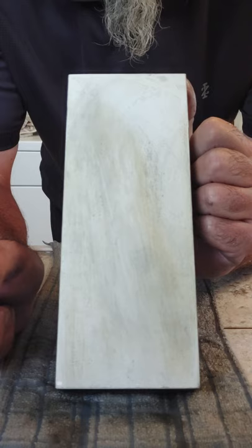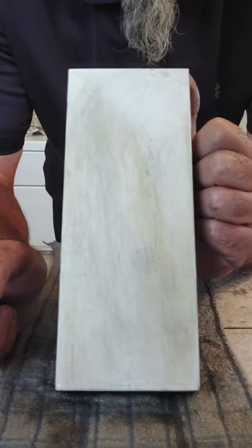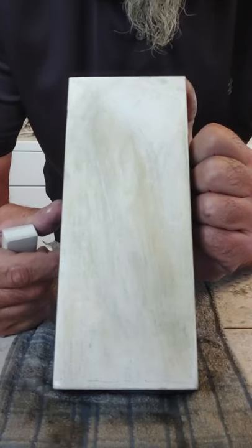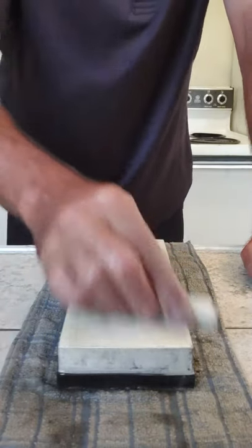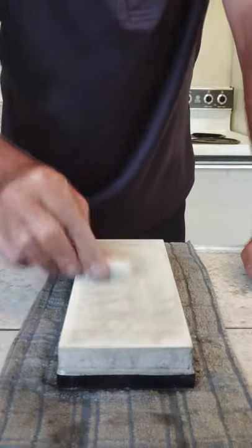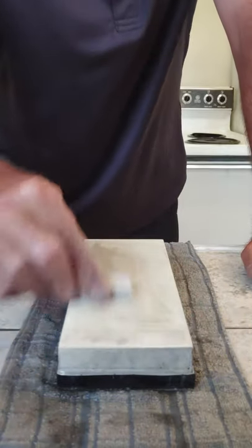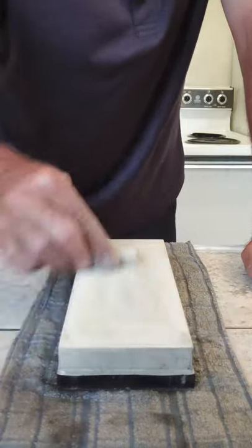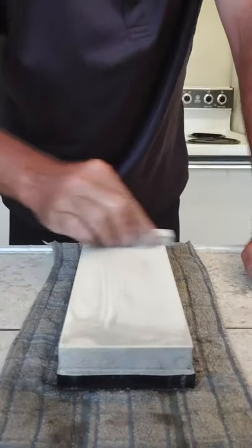The black is not yet oxidized carbon steel dust, basically. But you see this rusty tinge. That is particles of metal that are already rusting into the surface of this whetstone. So what the nagura does is to clean all that. It just cleans the surface of the stone, levels out any little tiny scratches and imperfections, and gets it all clean and pretty and ready for the next sharpening. It does a little bit of flattening if done properly.